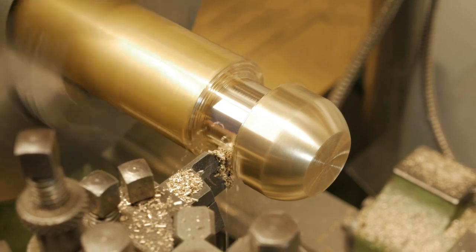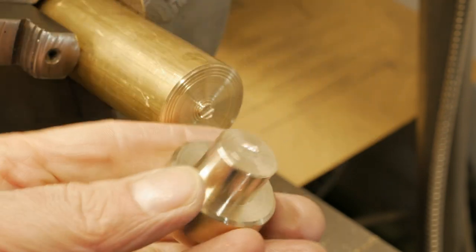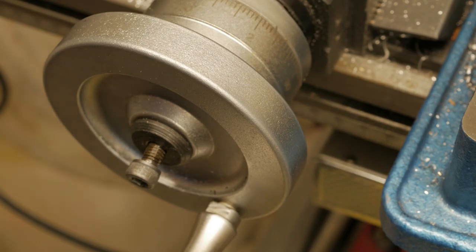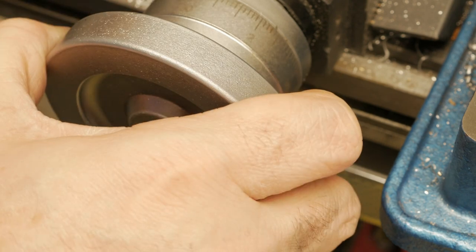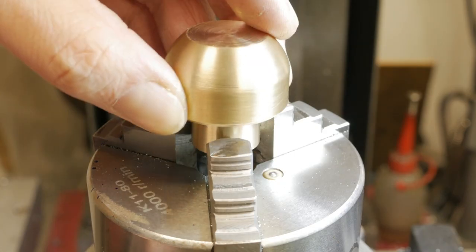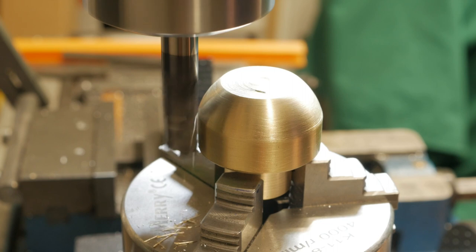I then drilled and created 2 M5 holes to lock the knob in place with respect to the 2 holes in the central shaft. I prefer to make 8 slots and not 6 in order to make the best use of the pole handle. Obviously, this required more work and attention too, but I really like the final result.